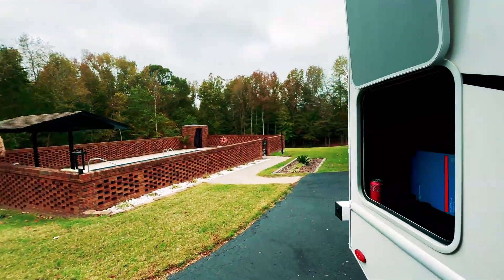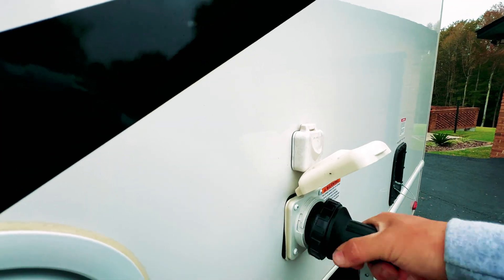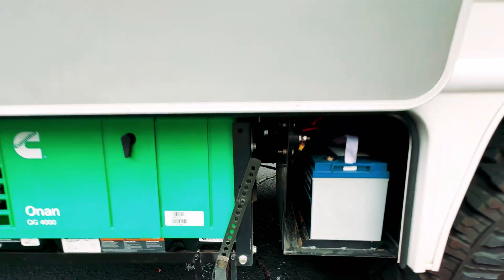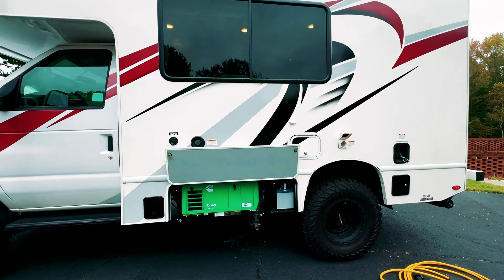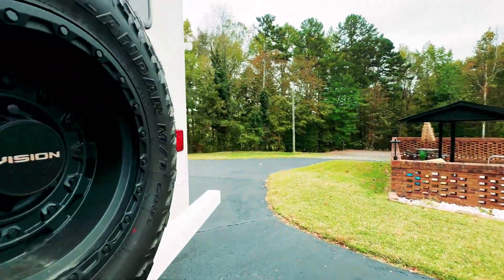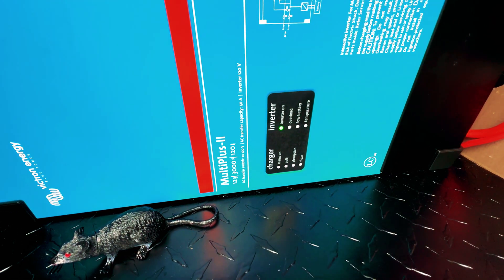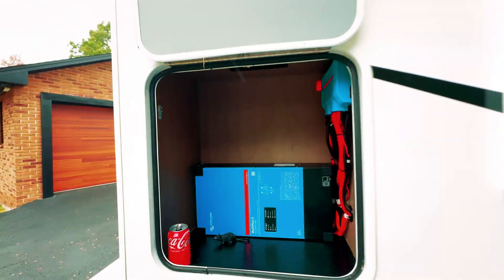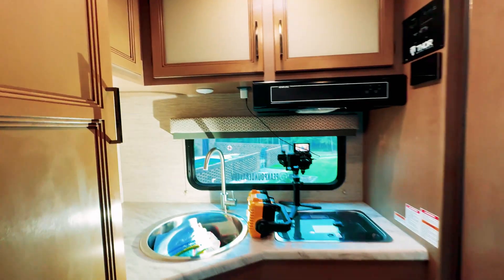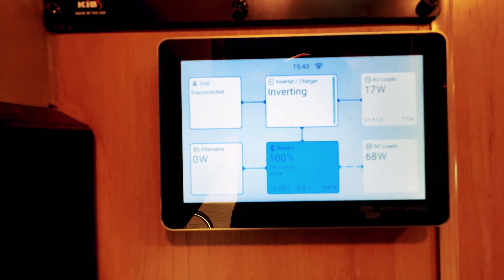Let's change that. I'm going to come around here and yank the shore power. I'll leave the 100-amp battery we were using as kind of a bonus for our guy — Merry Christmas in October. We're off shore power. Now you can see that instead of mains on and float, we have inverter on — everything's being inverted. Totally seamless. There's no indication that anything is going on other than regular power being delivered. Coming back to the Touch 50, we can see inverting and discharging. Grid disconnected.